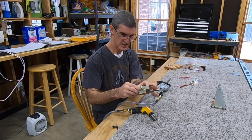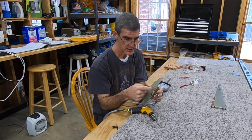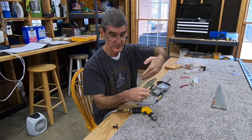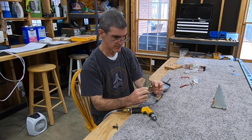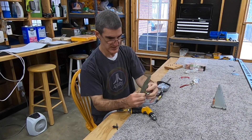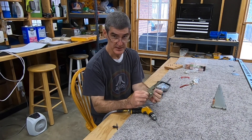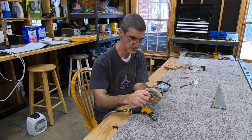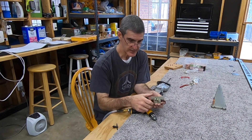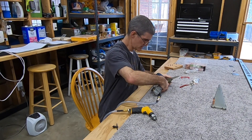What I'm doing here is I want to hold the nut plate as flat as I can get it. I noticed that when I put a Cleco in one side and a rivet in the other, the Cleco would hold it a little tighter and cause it to sort of tilt up. So what I've done is I've threaded the rod end and the nut that will eventually go on it in there just a little bit and jammed it down. I didn't thread it all the way in because I think the nut plates have a locking component to them and I don't want to use that up. I've gone ahead and tightened that down just enough to hold it, and hopefully I can get everything in here and squeeze the rivet with that on there.